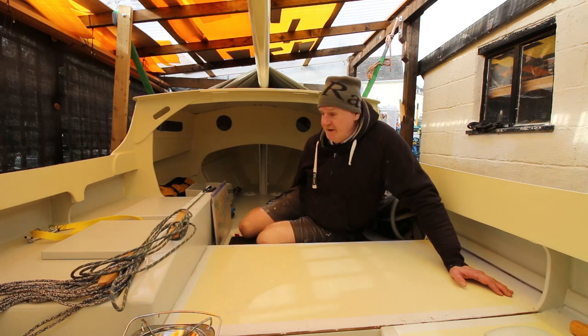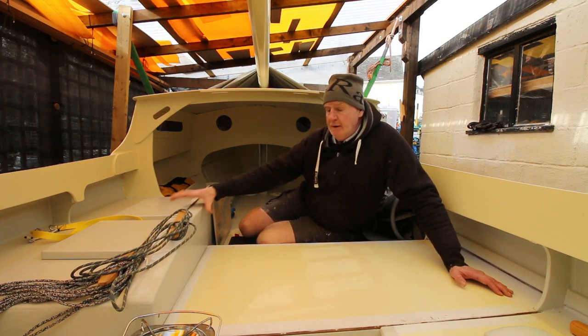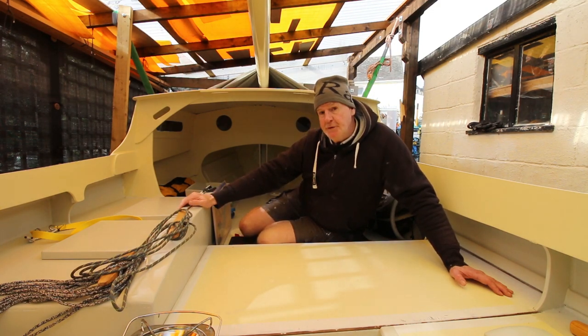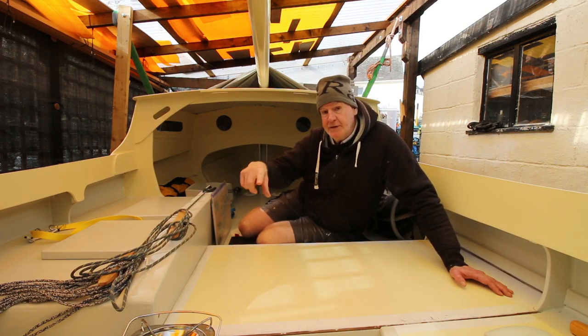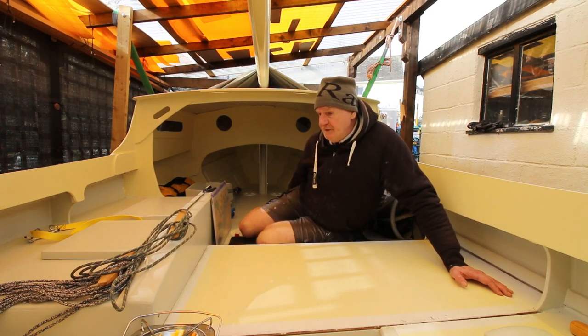But ultimately what I did was this simpler layout of just having the centerboard off to one side. And something that you'll see from the photographs is that the board case sits partially on the bilge stringer, so it sits on a very solid piece of boat.